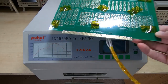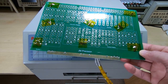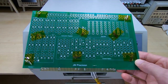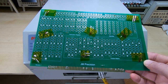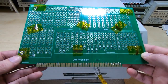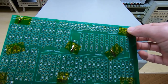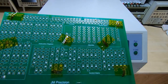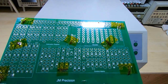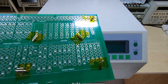The first thing I needed to do was figure out what the problem was, so I've created an instrumentation board. This is an example of the shape and size of the boards I tend to do — this is a through-hole version of the board we just looked at, but thermally it's very similar to the surface mount board; it's just easier to mount the probes onto. I have a number of thermocouples arranged to give a very similar thermal mass and response to the actual board and components. I'll fit this into the machine, do a number of runs, and look at the results to see what the actual profile is compared to the profile the machine is trying to create.